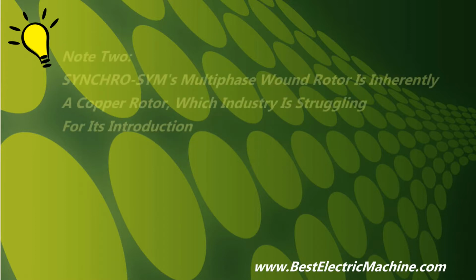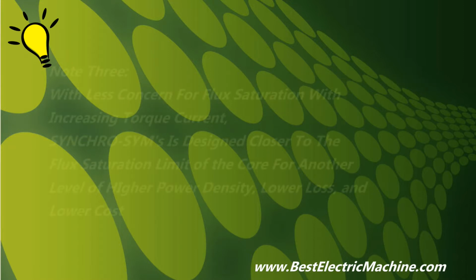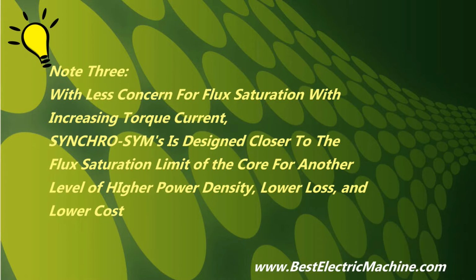Note 2. With the convenience of an inherent balanced multi-phase copper wound rotor, the new electric motor, again, provides higher efficiency, cooler running, and lower ownership cost than even the copper rotor expectations of the induction electric motor industry struggling for its introduction for at least meeting upcoming efficiency standards. Note 3. Unlike all other electric machines, the steady-state core flux density of the new electric motor can be designed closer to the saturation limit of the core without concern of reaching flux saturation with increasing torque current, which adds another level of lower cost, higher power density, and lower loss for the new electric motor.